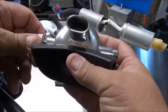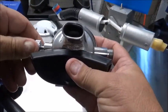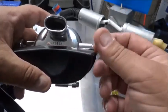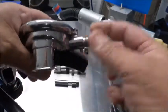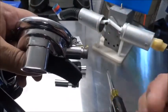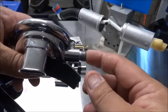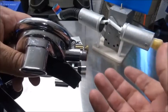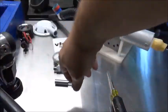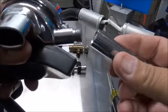So first things first, be sure that your adjustment knob is turned all the way to the stop. And then I know for a fact that we adjusted the demand lever in this regulator low. So it's going to have to come up. How much, we don't know. But I know when I first hooked the air up to it, it's not going to free flow. I'm going to use just the very basic inline adjusting tool. Forgive my camera technique here, I'm trying to reach over it.